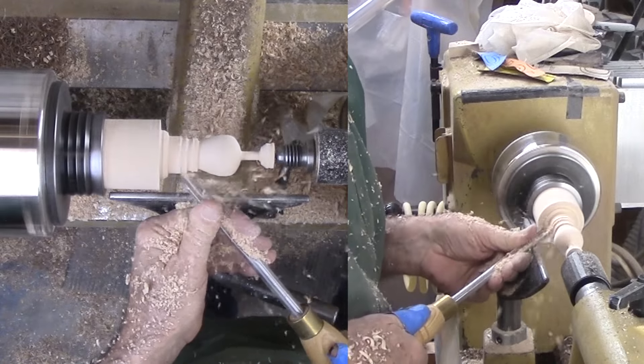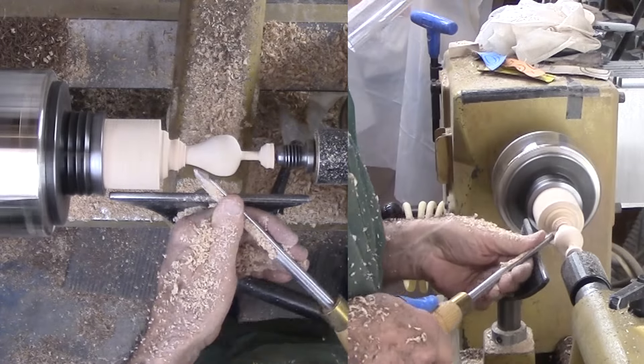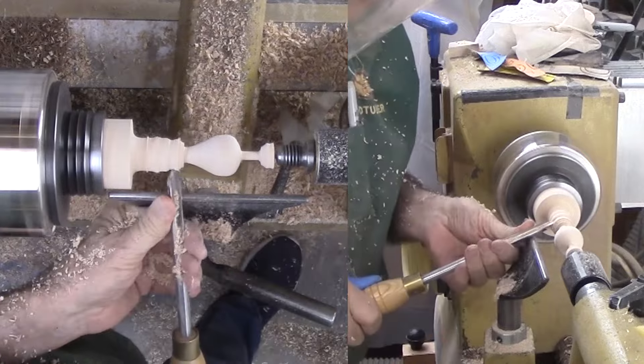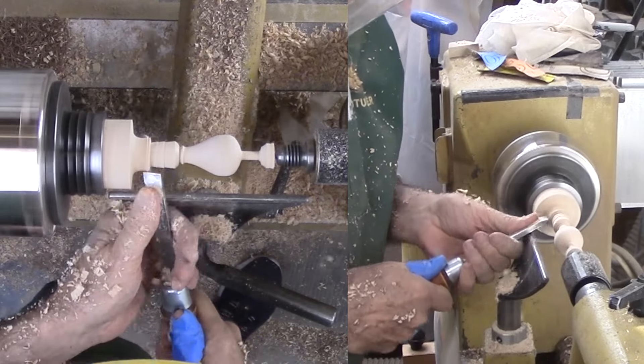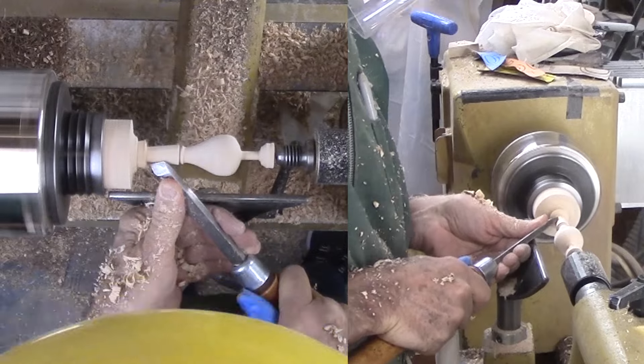Now the time is up — I have to commit to a profile. My compromise is to have a larger bulb near the cube, then work it down to smaller. For fine finial work I switch from the gouge to a skew. Finials are fun. I used to worry about them, but not now. I do not like sharp points on finials where children may be involved.